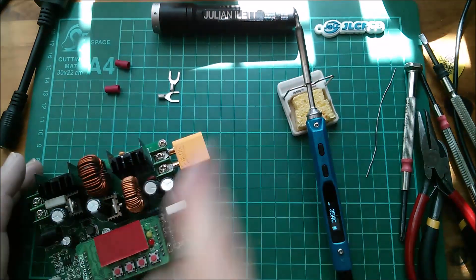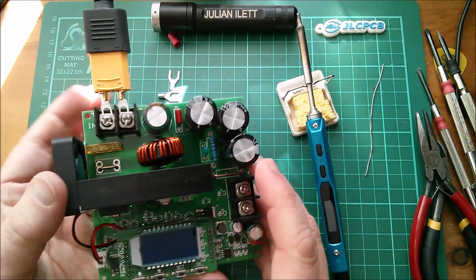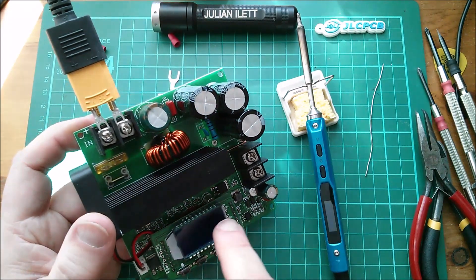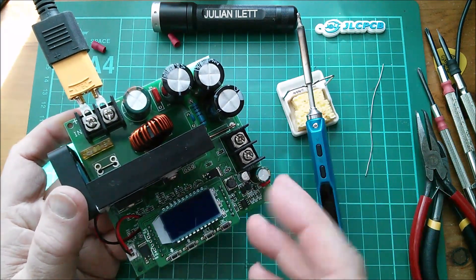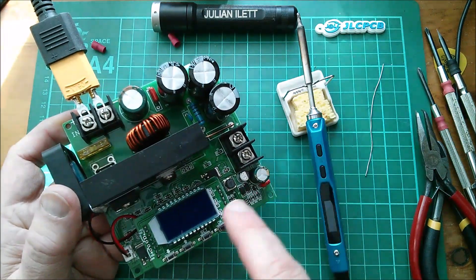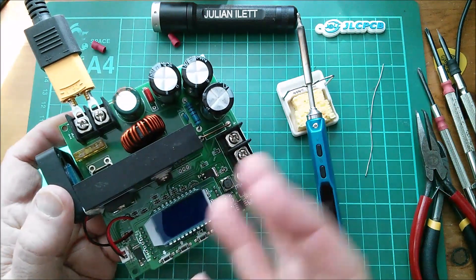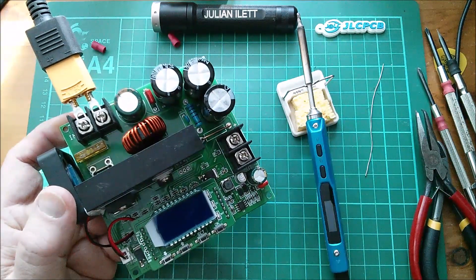Okay, that's it — let's take it outside. It's sunny, time to test it. Did it work? Yes it did actually. In the end I went for the BST 900 with the LCD; it also worked on the BST 900 with the LED. This is quite good because it shows voltage and current simultaneously. It also worked on the original buck boost, but the problem is that boost-only converters are better because when you switch them off they still pass the solar panel power through to the output. I'm going to do that as a big reveal on my main channel — 'Jackery power boost technology' something like that.